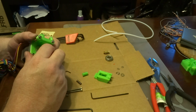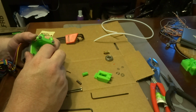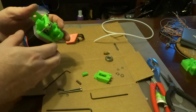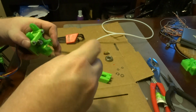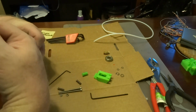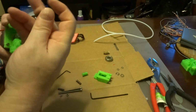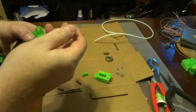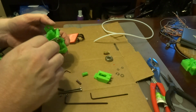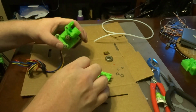When you get in that situation, what you really want to do is pull out the filament, cut it off so that it's back in the round, and then not crank it down so much, okay? Because all that you need, if the filament is round, is enough tension to push your filament through the tube.